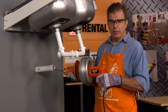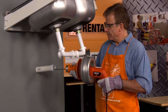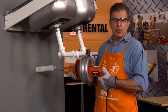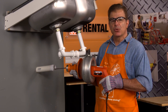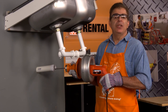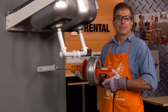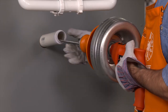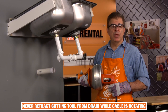If this happens, switch the motor to reverse, pull back on the grip shield, and run the machine for only a few seconds at a time. Running the machine in reverse longer can damage the cable. When the cable pulls free, put the switch back to forward. Continue slowly working the cable into the drain a few inches at a time until the drain is clear. After the drain is clear, with the trigger switch in the forward position, slowly pull the cable out of the drain and feed it back into the drum. When you get close to the end of the cable, stop the machine and pull the cable out of the drain carefully. Never retract the cable from the drain while the cable is rotating — the cable could whip and cause serious injury.